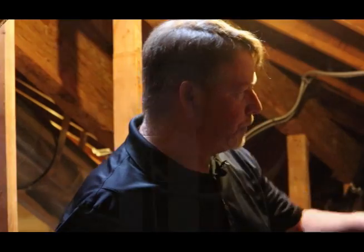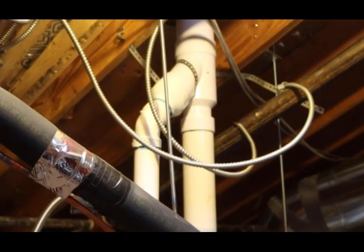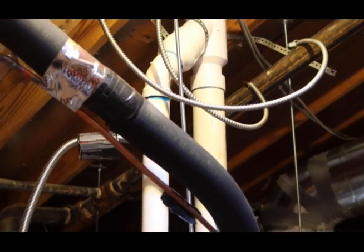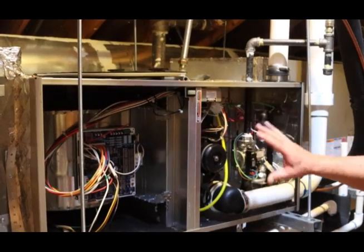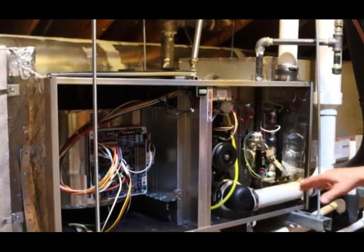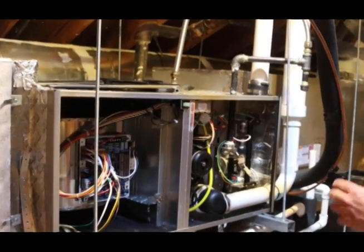A quick way to tell if you're looking at a furnace unit, whether it's sealed combustion or open combustion, is these PVC pipes right here. We've got one that comes through right here that is an air intake, and this other one at the bottom is an exhaust pipe. On an open aspirated system, you've got these little louvers where it draws in air from the attic space.